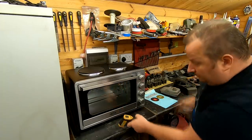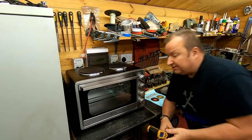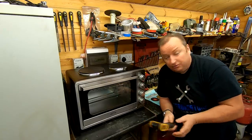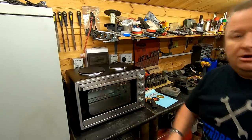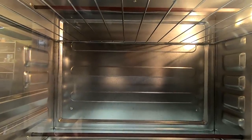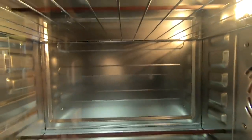Let's have a little temperature check. Just opening the door now — look at that, 178 degrees centigrade. We're looking at 180 so we're basically up to temperature, and that's taken five minutes if that. All I would do then is put my powder-coated part hanging in there, leave it for 10 minutes. I can actually look at the piece through the glass door, and as you can see it's ideal for filming — I could film the transformation of the powder coat. Just keep your glass clean and you can actually see and film the powder coating, which looks absolutely fantastic.